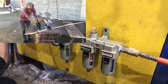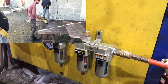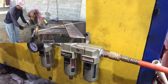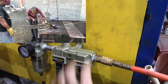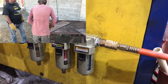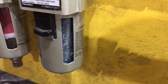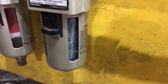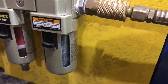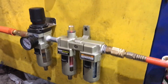Here's the air filtration system I showed in another video. I want to show you how well the refrigerant air drying system works. I was doing plasma cutting on a job site recently with just this and an air compressor. I had all the desiccant pretty saturated, but the air from the refrigerant air dryer is so dry that just running air through the system actually dried the desiccant out — it went from pink back to blue just from running air through it.